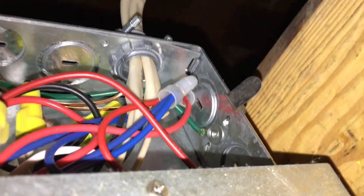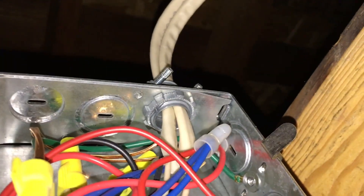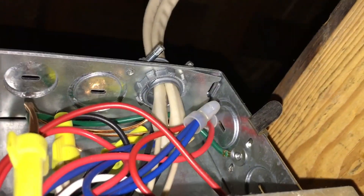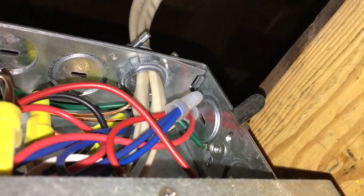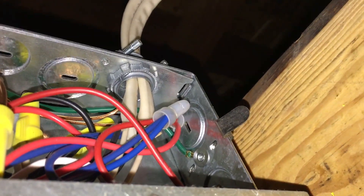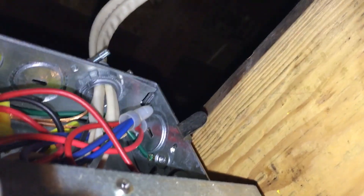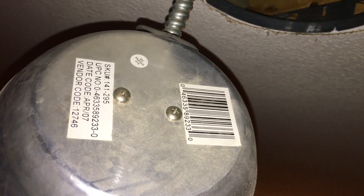What we have to do is use the existing wiring and cut some wires. We've got power coming in through the white wire - that's the main power. It goes into a ballast and then gets routed to the fluorescent bulb socket. Instead, we're going to route the power directly to the fixture, which is all the LED fixture needs.